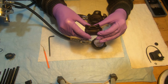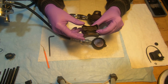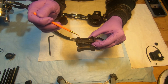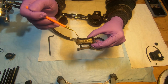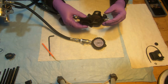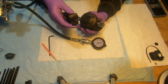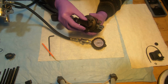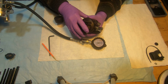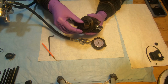This is where this tool will come in handy. You notice the tool has this shaped handle, which has two sides. This side inside says no flow, no gas flow, and this side says gas flow. When we press the no gas flow side, we have to align it. It's shaped like your purge button. So we align it and press firmly so it's completely engaged. We should not hear any flow, like right now. But when we turn it around, we should actually have a flow.